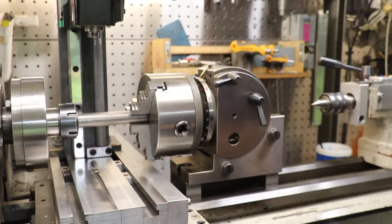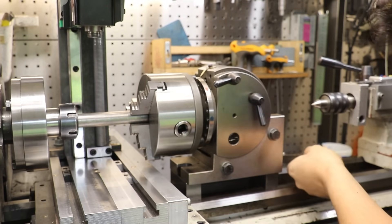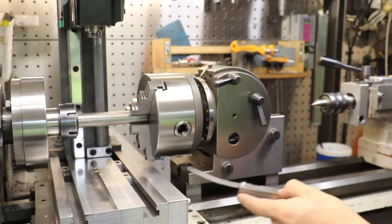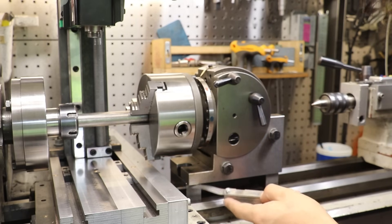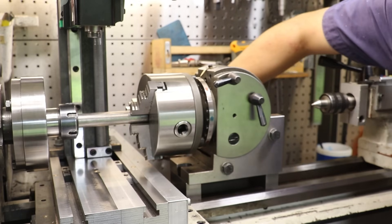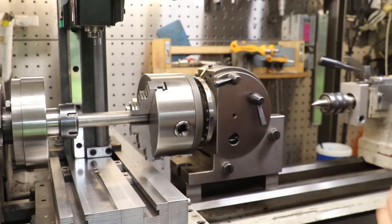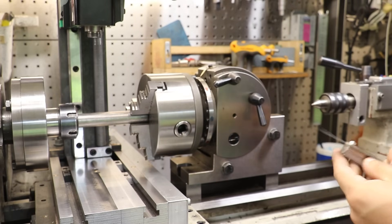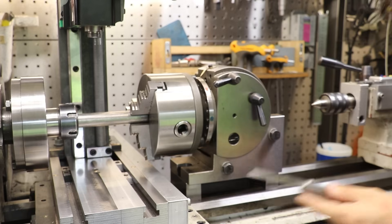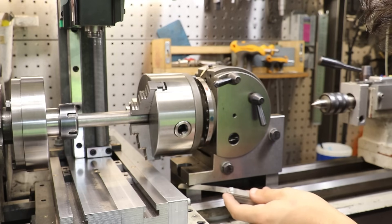Now this probably isn't going to be the best test to see whether it's perfectly on height, but I do think that it should work. I've got the part chucked up on a 17mm piece of steel and that's firmly tightened on the chuck's end. I'm now going to use a feeler gauge to see if there's any gaps between the dividing head and the riser blocks. If the heights were off, you'd expect one end or even both ends to have some amount of gap. And even with my thinnest piece of shim stock I couldn't see any gaps at all. So I think for this sort of setup that I'm going to use once, I'm happy enough with these results to continue.